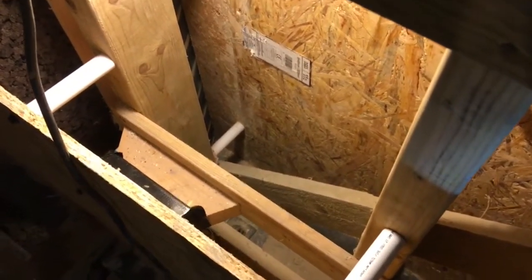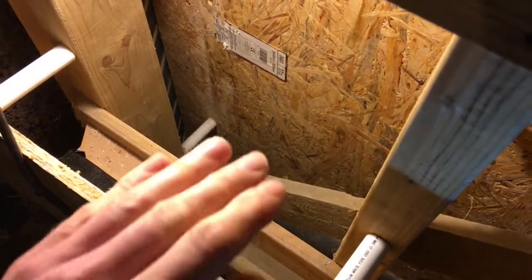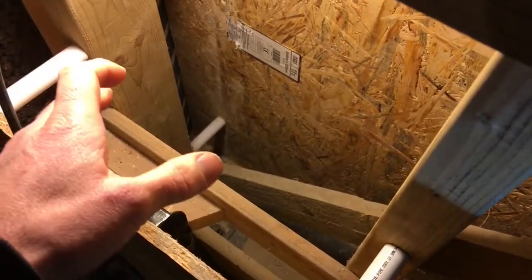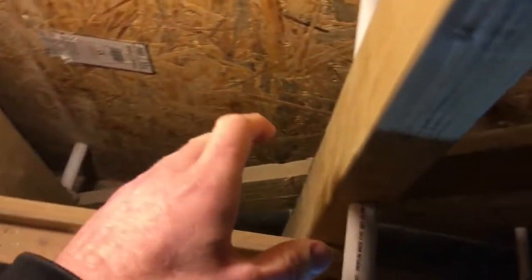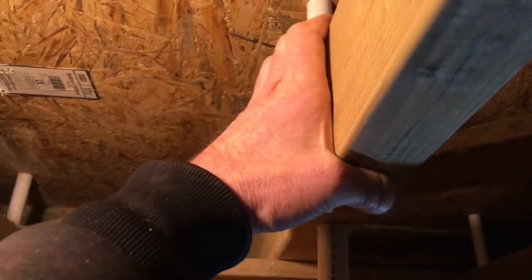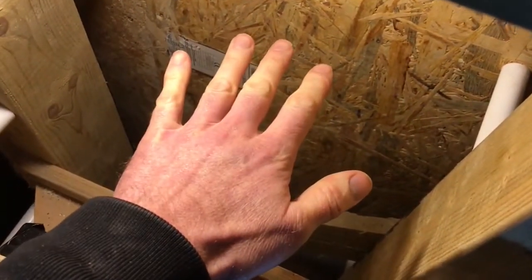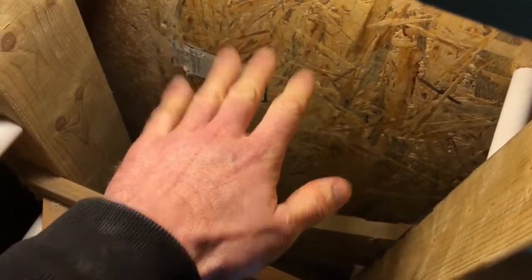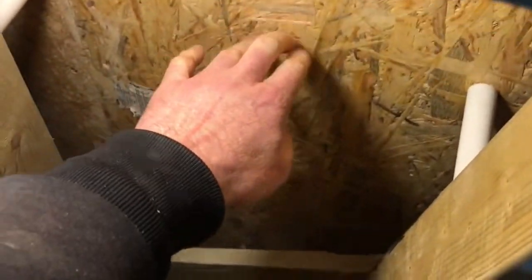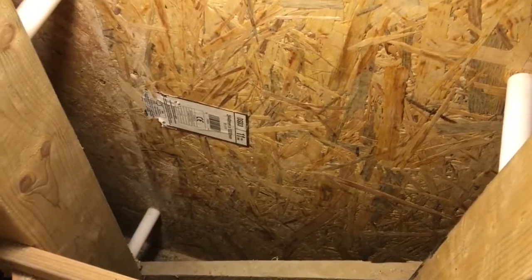You can adjust the density within the wall according to what you're trying to achieve. If there's a vulnerable corner you can press it down a little bit harder to get a slightly stronger area of the wall at the expense of a little bit of thermal insulation. Around the timbers you can tuck it in harder so the hempcrete is held tight to those, whereas in the middle of the void it may as well be a bit looser because that's where it's doing the most insulative work.